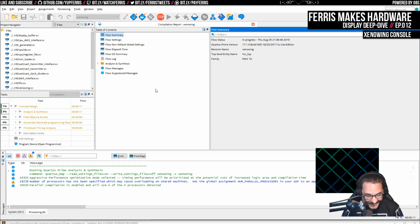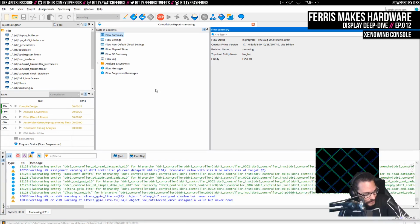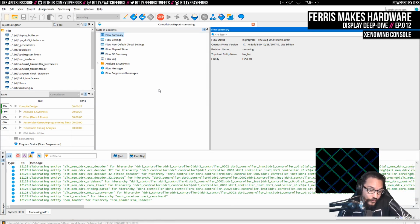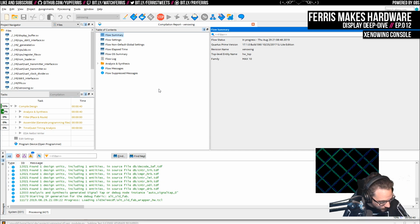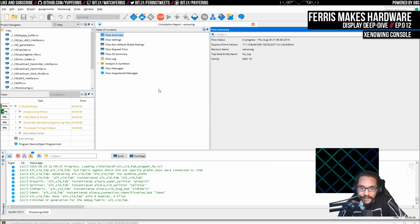Yeah, I'm happy to see it working again too, to be honest. But in that case, it's probably timing issues, and then again, more motivation to actually look into that. I think I complained about that last week on stream as well, that I was having those timing issues. In fact, I didn't even know to check the timing analysis until really weird stuff was happening because I was violating it a lot when I rebuilt the CPU. I had a really long path from the input to the register file all the way down to memory issues because I had some things messed up there. And then a colleague of mine, because we have an FPGA team at work, suggested I check the timings, and he was right.